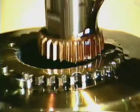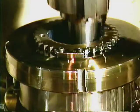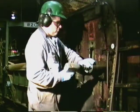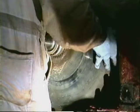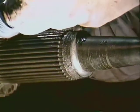Splined bore arbor sleeves in combination with machined eye saw blades now allow for the backlash clearance to be reduced to as little as three thousandths of an inch, ensuring that a small backlash clearance is maintained for a prolonged period of time. The universal sleeves make repair and maintenance faster and less costly. For example, one worker was able to disassemble and change all of the sleeves and then put the system back online, all during the lunch break shutdown.